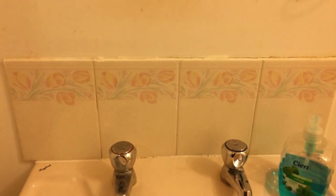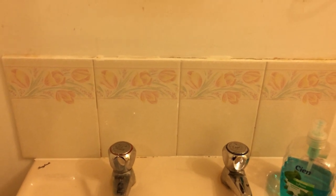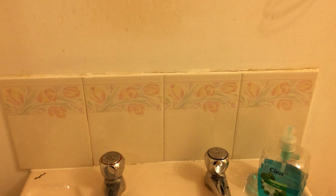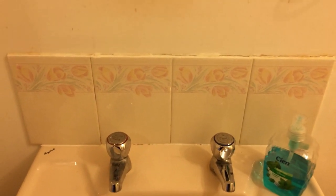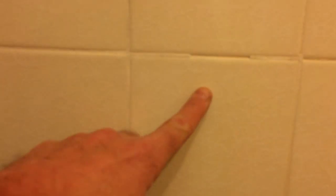The tiles are hideous, but here's a cheap fix I do quite a lot on rental properties: I paint tiles. I've got a white satin paint — it's Rust-Oleum all-surface paint, I'll show you the tin when I'm doing it. Basically we give these a good clean with sugar soap, re-grout the tiles, then give them three or four coats of this paint. It's not technically a tile paint, it's an all-surface paint, but it's really good — I've used it for a few years. It just gives the bathroom a new look. All the tiles here will be painted satin white. The grout is shot on these tiles, so I'll dig out the surface grout, re-grout, and then paint it with the tile paint.